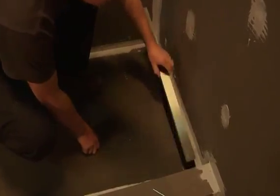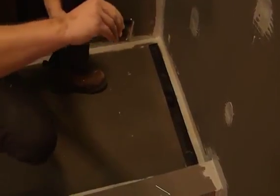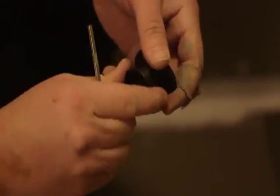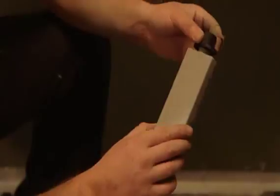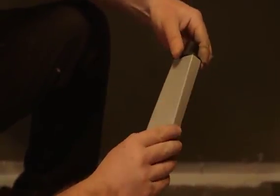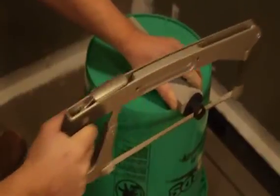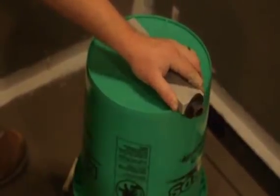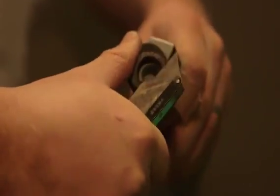The drain cover columns are now reduced and cut to the size we need for our tile's final installation height. To cut the column support safely and exactly, we take only the threaded part of the column support assembly and screw it onto the channel spacers as shown here. The spacer is now just used as a helpful device to allow for a good cut using a fine-toothed plastic or metal handsaw. Cut the threaded component to length as required and clean scrap plastic off the part. Repeat this process for all other column supports and assemble them again.